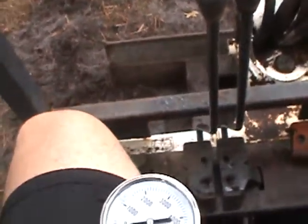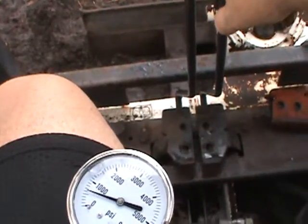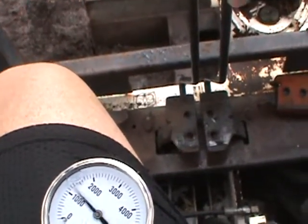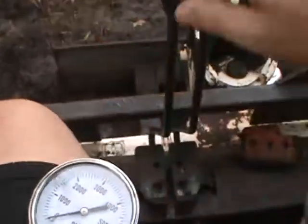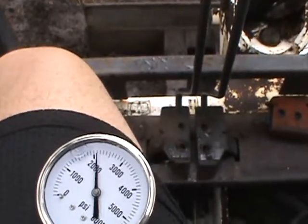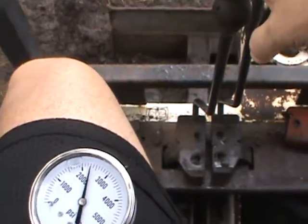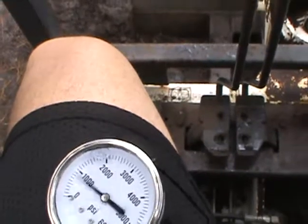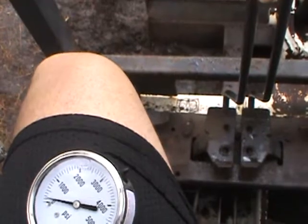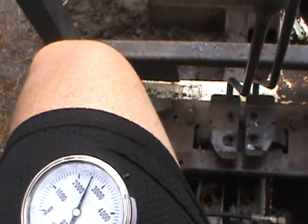All right, this is your motor. It goes all the way to bypass, so I'm getting plenty of pressure — no movement. Reverse, same thing. Moves for a second and gets to bypass. You can run it on up here a little bit. 2,500 PSI. Not moving the motor.